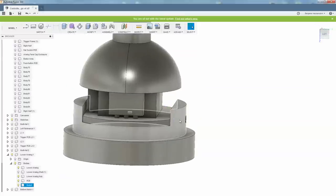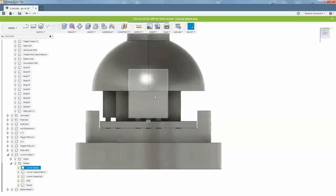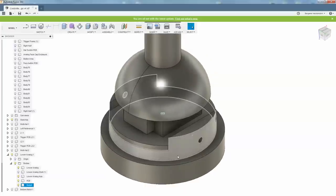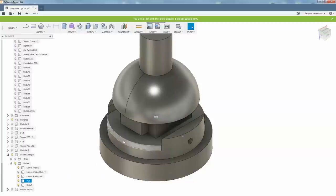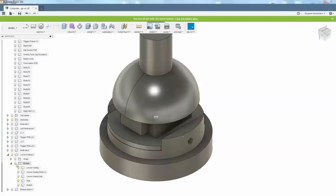Yeah, so I had to actually recess these flanges. See how the flanges are not that much higher than the PCB? That's because of the rotation of the analog stick itself, it would hit them. So that's why I had to do this subtraction thing. So I actually recessed it down. So this isn't flush, but it should still work. Although we need a way to hold this down. Because if you think about it, when the cap goes over it, what actually holds it in place? What prevents the stick from lifting up?